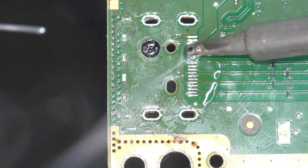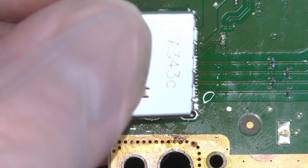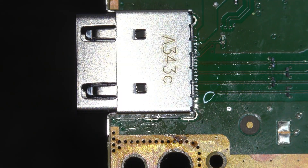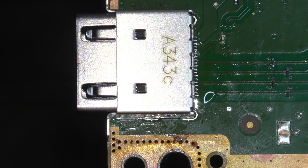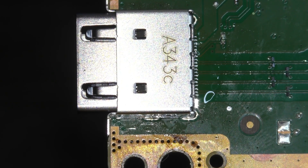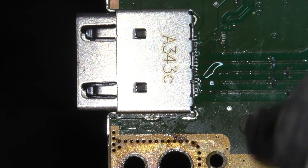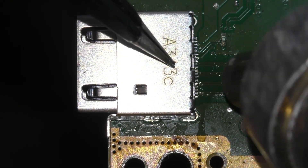If you've made a mess, feel free to clean up some more and reapply clean flux. Once you're happy, grab that new HDMI port and push it into position. Check the pin pad alignment is good. If not, you may need to clean out those locating holes a little bit more. The alignment of these replacement Series X ports is actually pretty good — there's no adjustments or anything necessary, or at least there shouldn't be. Once you're happy, ensure you have a healthy amount of flux applied and get the heat gun back out. I use 480 degrees Celsius at 100 litres per minute of airflow for this.